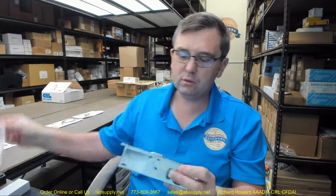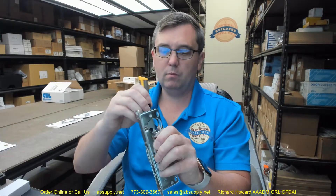It is certainly used in aluminum storefront applications. A hook bolt — you can see why it is called a hook bolt. A hook bolt is really great because it will prevent spreading of the door and frame, or at least work to defeat that sort of attack.